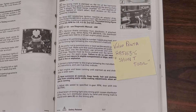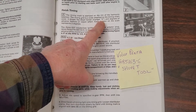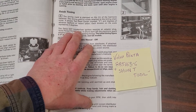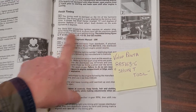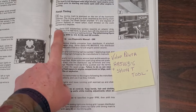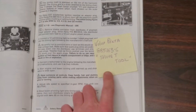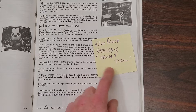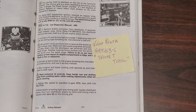When we go into the book and it talks about ignition timing, it talks about timing this particular engine at zero degrees. It says this Delco EST breakerless ignition system requires an adapter plug shunt tool, which basically shunts the spark advance in the module and sets it at base timing — that's zero degrees. The part number given in the book is Volvo Penta 885163-6. If you type that into a Google search, it'll come up and it looks like this.